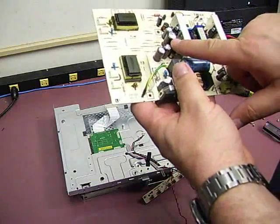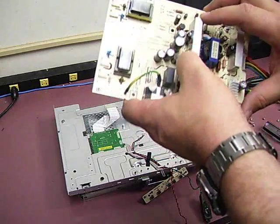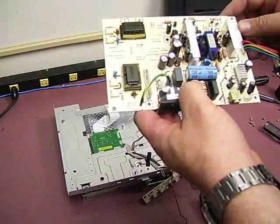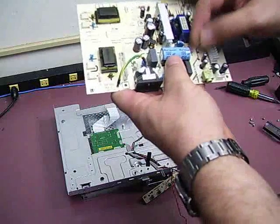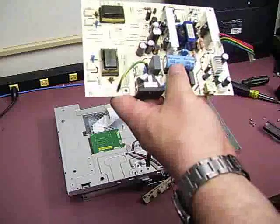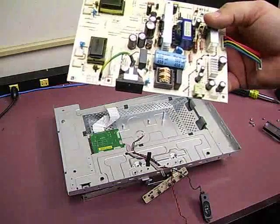It's very evident that this large capacitor is bulging — I'm not sure how well you can see it on the video. But while we're replacing it, it's best to go ahead and replace the rest of them on the board. These are the power supply capacitors. These capacitors are for the audio amplifier — they usually don't go bad, so we won't be replacing those; just the ones for the power supply. So let's take it over to the soldering iron and see if we can get it fixed.